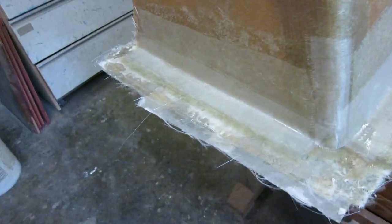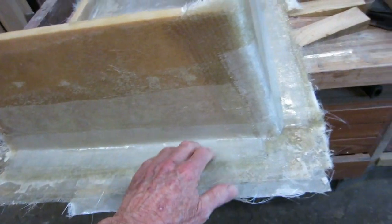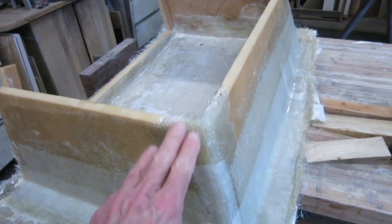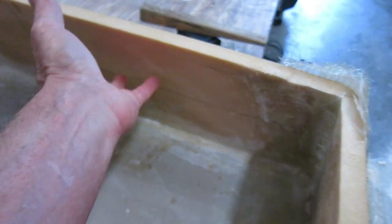It's been a couple of hours. I've had four layers in this corner, which means this flange is four more layers thicker than it was. I'm going to trim it because I can't really tell how thick it is, and I'm going to trim this mess and go ahead and put a couple of layers on the inside. I'm not so worried about the inside structurally — I just need some glass to cover it — and then I can round these corners and pretty much finish glassing it if I can stick with it.